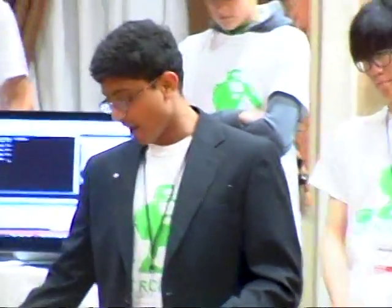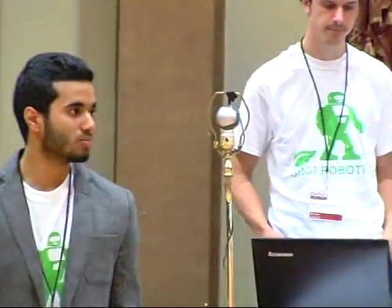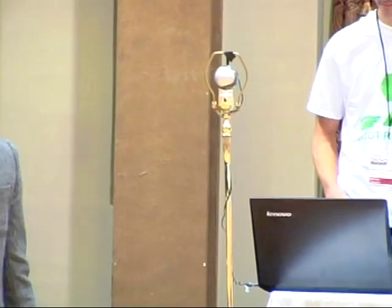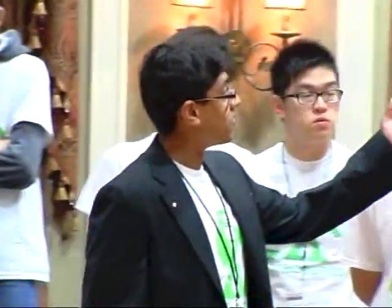So the Raspberry Pi receives information, sends it to the Arduino, and the Arduino acts on the motors. And then the motion is sensed by this webcam over here. And then the correction is made on the computer. And then we have that feedback loop that you can see over there. And if everything goes correctly, it should follow our movements as we tell it to.